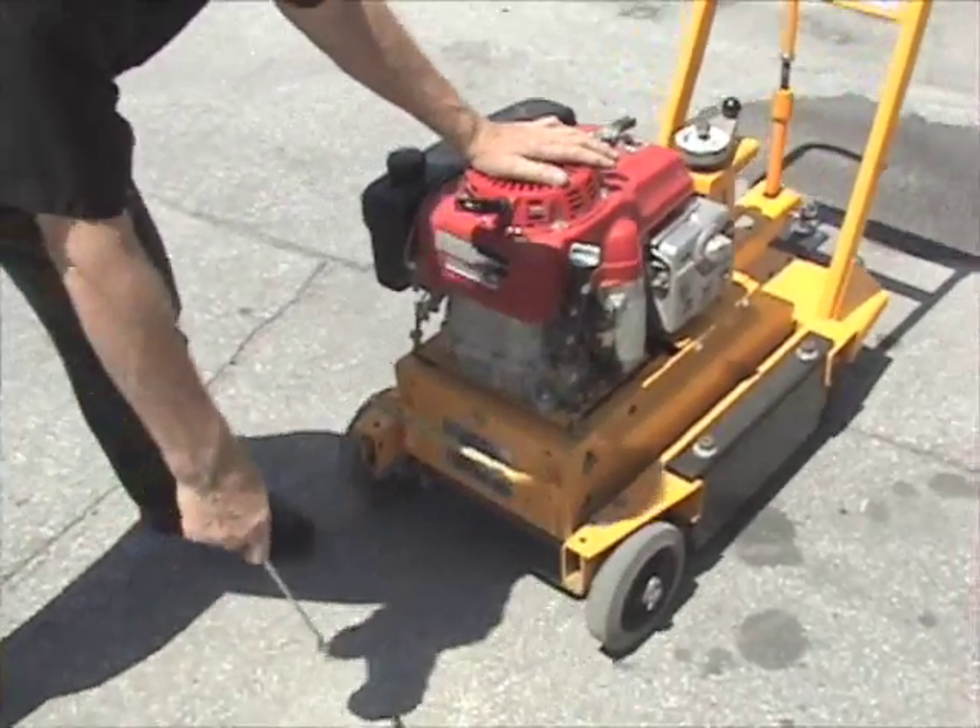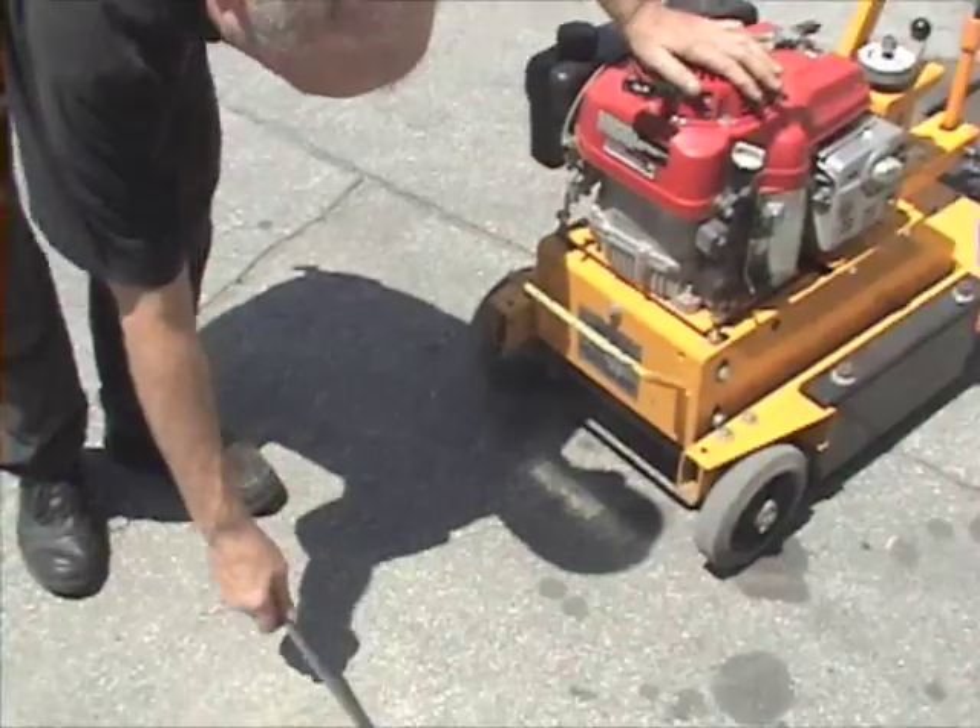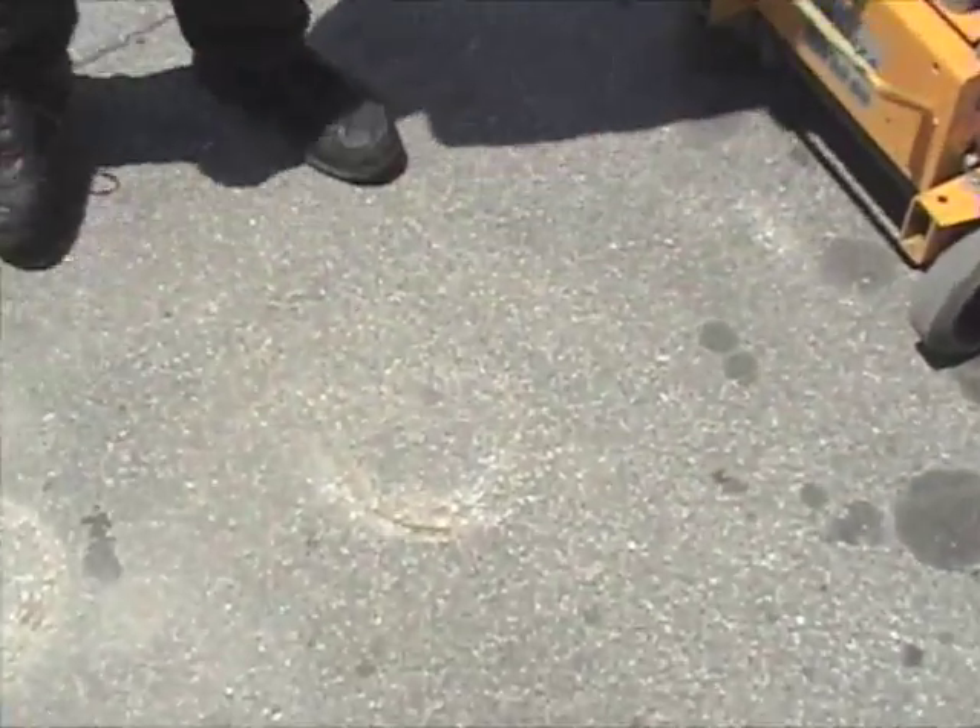Right here, you can see a very small partial pattern. When the heads come down like that, that means that you're touching on one side only.